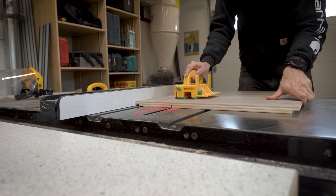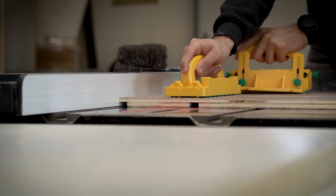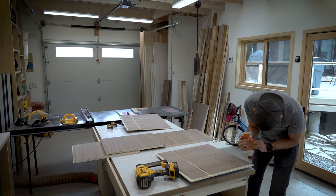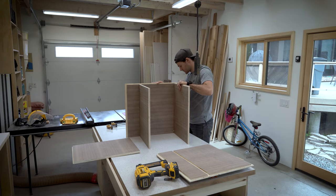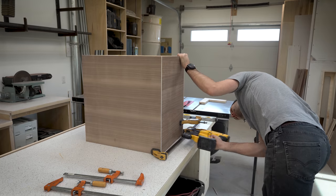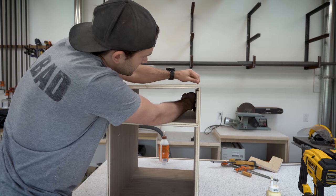After that I started cutting the larger panels that would form the exterior of my cabinet. To make assembly easier and my boxes stronger, I cut rabbets into the upright panels. Because I didn't feel like installing my dado blade, I cut the center channel out one blade width at a time. Then it was time to assemble these cabinets — I applied some glue into my rabbets and dados, used a 90-degree jig in the corners to keep everything square, and then pinned everything together. I did the top and middle stretcher first, then installed the bottom afterwards.